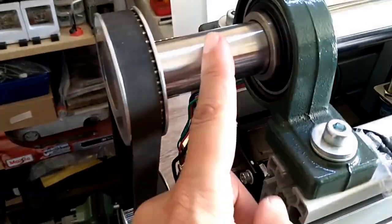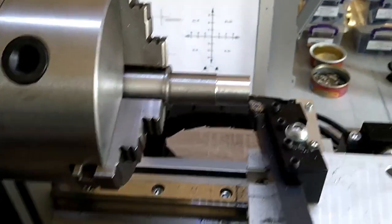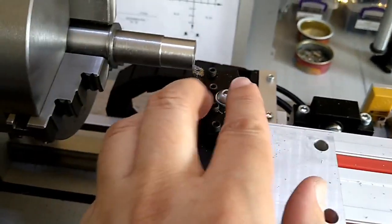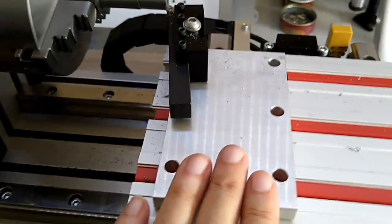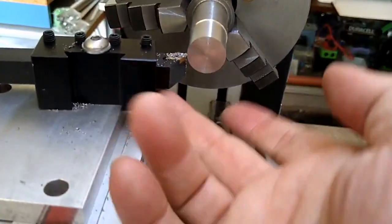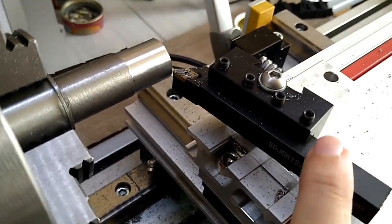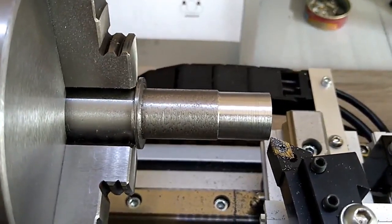I also installed my indexing sensor for RPM and a second stepper motor. I ordered the pulleys and belts, which will be used for indexing the chuck so I can cut spirals or whatever. I'll also mount a small motor here with an ER11 chuck to cut slots or anything I want. I still have to make the proper tool holder — this is just a temporary solution where the tool holder is hanging over — but it works, it cuts, and I'm very happy.